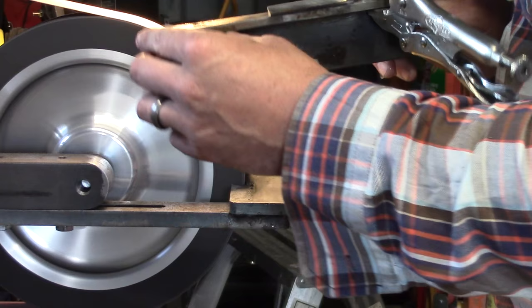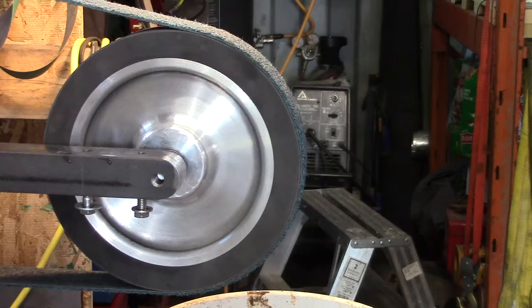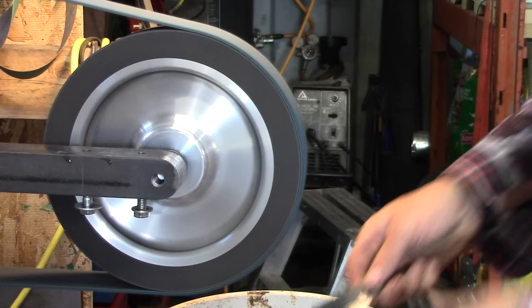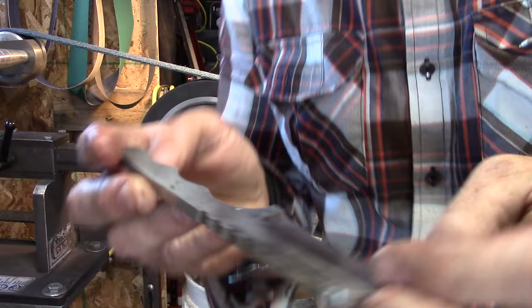I want to make sure I've got really nice plunge lines and nice grind lines at the top, nice and straight. That looks pretty good for a rough grind. After that I take a surface conditioning belt — think of it as a Scotch-Brite belt — and put a finer finish on the bevels. I'm not doing a lot of hand satin finishing anymore because I really like the look of that fine grain, and those surface conditioning belts do a fantastic job.